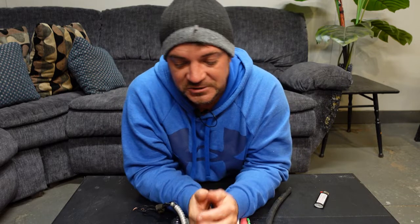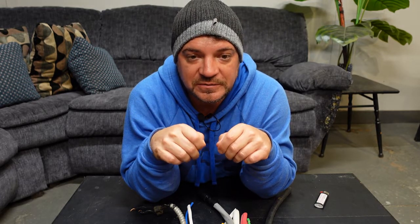A little history about wiring: basically in the 40s and 50s we all know the term knob and tube. Knob and tube was basically two wires separated by a joist cavity — the neutral running on one side and the hot on the other. They called it knob and tube because the wire used to hang on porcelain knobs and go through tubes when passing through a joist cavity. Typically they would run one circuit from the basement right up through the center of the house.